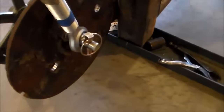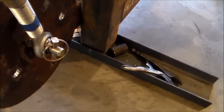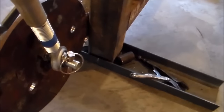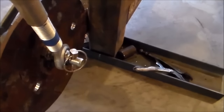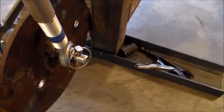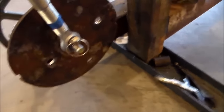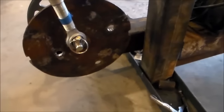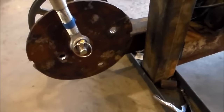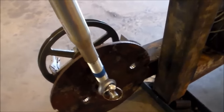What I had to do is machine a little bit off the pin. The category one pin that goes on the equipment for the draw bar — I believe it's one inch — and for the top link, I believe that's a three-quarter inch, so I had to machine a little bit off that pin. I've got holes at two-inch, three-inch, four-inch, and five-inch, and I can change the stroke just by relocating the pin and adjusting the rod.